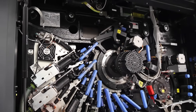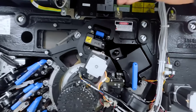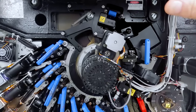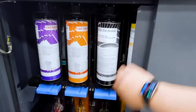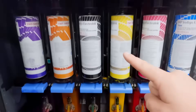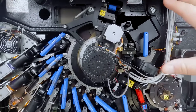I'm going to open this up — inside here is the print engine. From up here there's a laser writing head that images down onto a drum. From the drum, it images with a positive charge, and whatever's positive the ink will stick to, and whatever's negative washes back down into the tanks. Whatever's positive sticks to the drum, and whatever's negative drops back down.